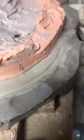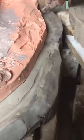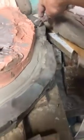It just means you have to be a little more cautious when you're doing the fiberglass on it, so that you're thick enough at that point that you didn't actually cause a weak spot, because you made it too thin on the other side, so you've got to make sure you groove that pretty good. I'll just go ahead, since I started it on this one, and do that bigger groove, because I already have to compensate for it.